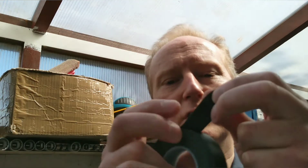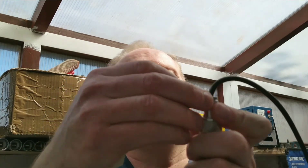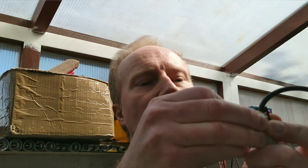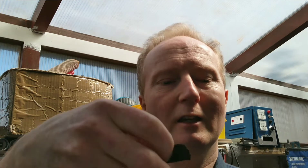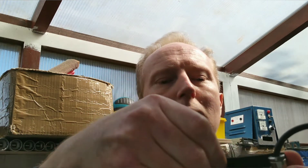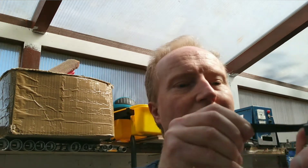So that is why we use self-amalgamating tape. I'll just pull a piece off. The good thing about self-amalgamating tape is it's stretchy. We would first of all peel the backing off because it's not going to stretch with the fixed plastic on. As you can see, it stretches — you can pull it round like that. You don't need much because it's stretchy.